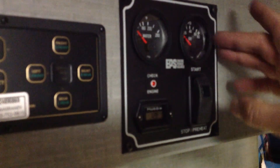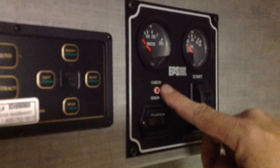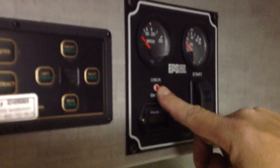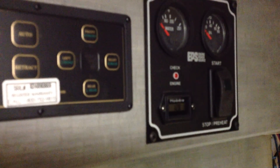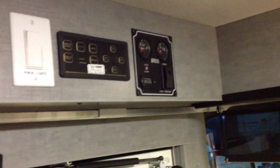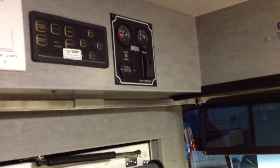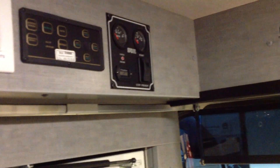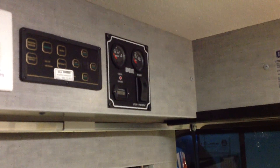This is a backlit feature, so when I start it the lights will come on. You have a check engine light that should disappear — that will let you know when you need servicing. This rectangular feature is actually one of two displays. It shows a voltage of 12.8, and then it'll switch momentarily when the unit is running to tell you the number of hours the unit has been running. Since we're in the building and not running the generator, you're not seeing that switch occur.